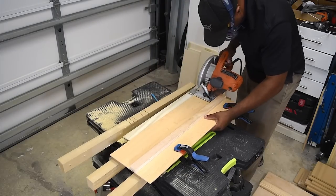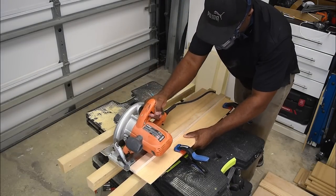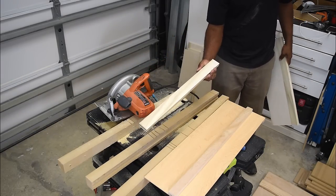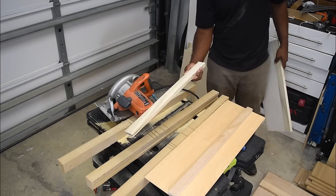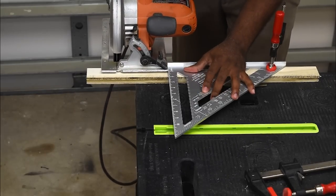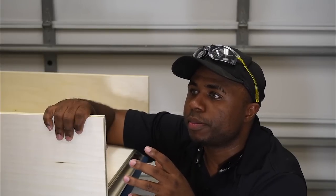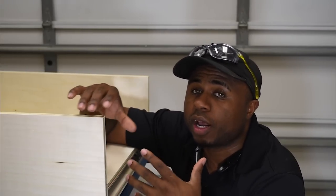The plan is to utilize as much as possible from a half sheet of plywood. I'm going to use this piece as a spacer between the two pieces of the seat. I need to make two of these cuts before assembling. Next I'm going to cut that piece down so it can fit between the two sides of the arms.